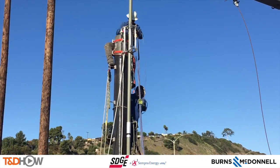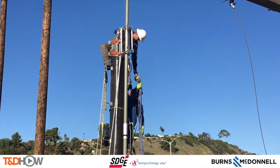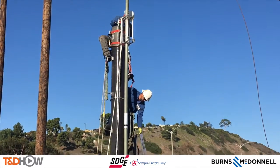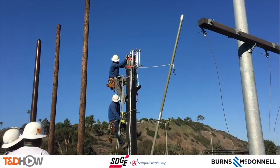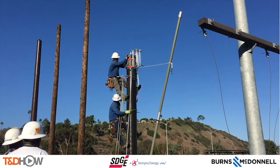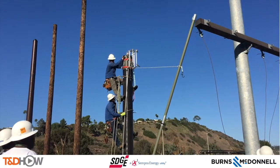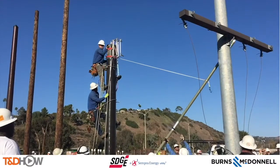What we saw was the installation of a multi-piece fiberglass pole for hard-to-reach areas. Fiberglass works in swamps and in backyards — these sectional poles are ideal where you can't get a crane. Some poles are 500 feet from the road, lot lines are really tight, and there's nowhere to work inside. So these sectional composite poles are ideal for those situations.